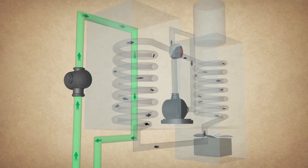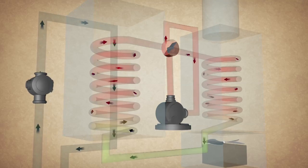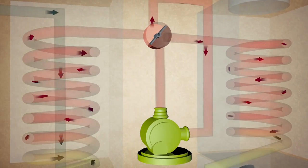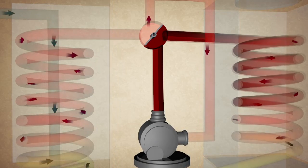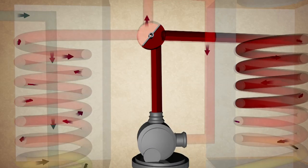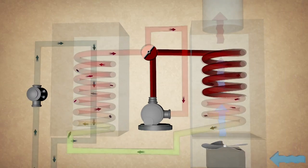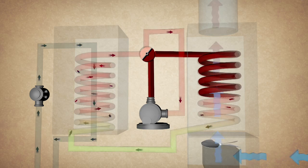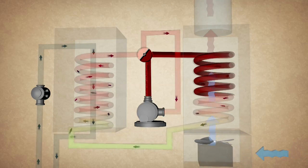The water or antifreeze is pumped into the heat pump, and in the winter, the heat is transferred to a closed loop of liquid refrigerant. That refrigerant now goes into a compressor, which uses electricity to compress the liquid refrigerant, turning it into a gas and making it very hot — maybe 130 to 150 degrees. In a typical forced air application, air is blown across the coils of that hot gas, heating the house. The refrigerant is then cooled by the air, it turns back into a liquid, and the process repeats.